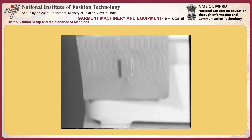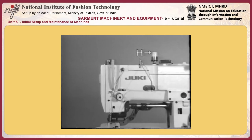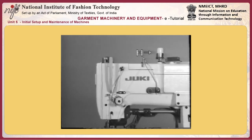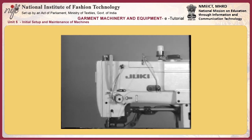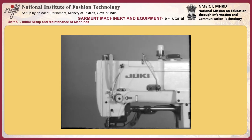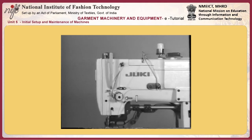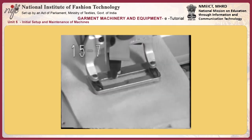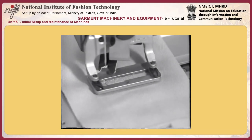Adjusting the needle thread tension. Firstly, adjust the thread tension for bartacking sections B and E using tension controller number 1H to allow the needle thread and bobbin thread to interlace with each other at approximately the center of the material thickness. Secondly, adjust the thread tension for parallel sections C and D so as to produce adequately formed seam crests. Tension controller number 2I has a spring that delivers a high tension as compared with the spring mounted in tension controller number 1H. Be sure not to tighten tension controller number 2I to exceed the required tension, since the excessively tightened tension controller can give rise to thread breakage.